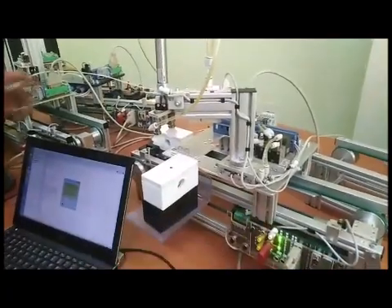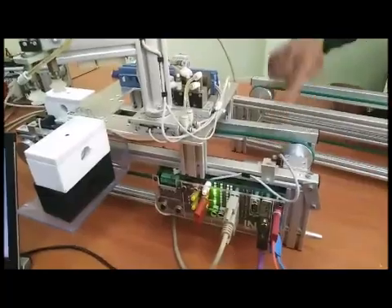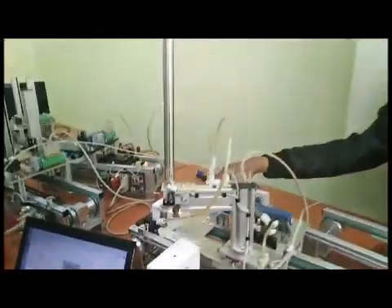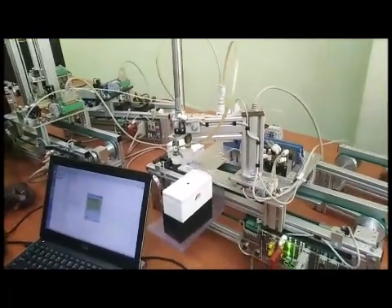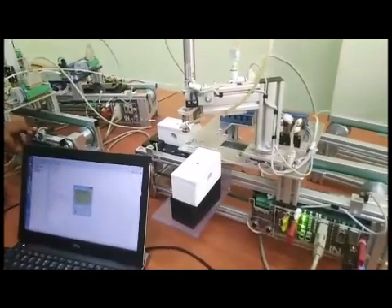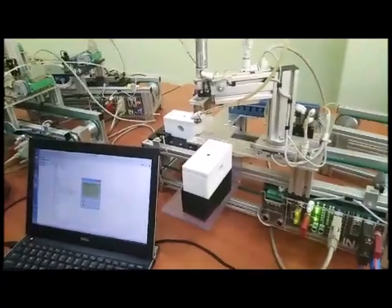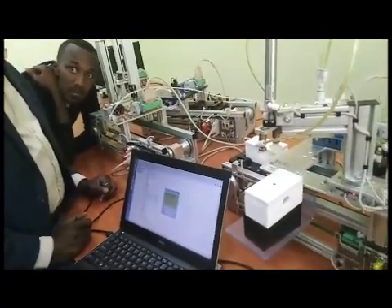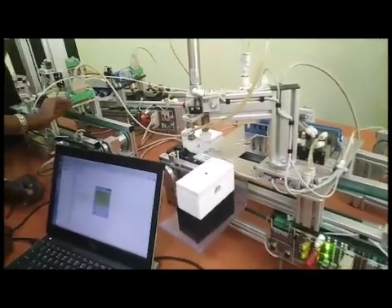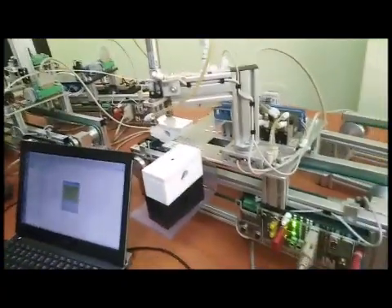For this one to move and continue moving, it must have this magnet — meaning these sensors are sensing the magnet, the presence of this one. If you connect them as a whole station: if this one energizes this station, it energizes the next station. The way you start the PLC, it acts sequentially — continually sequentially. So if this station is activated, it has to activate the next station for the process to continue.